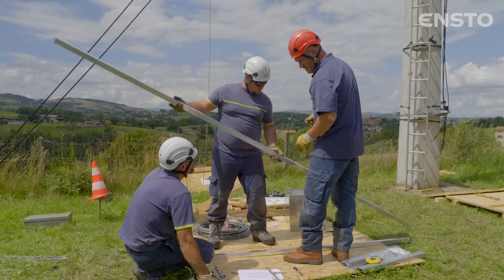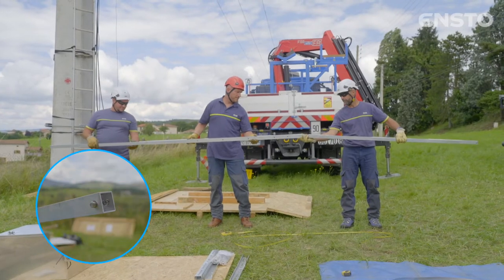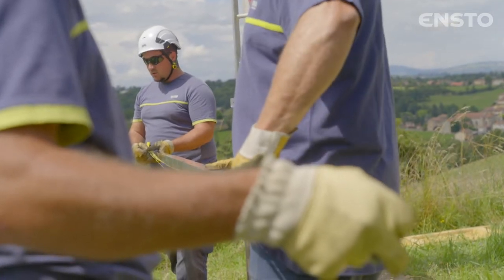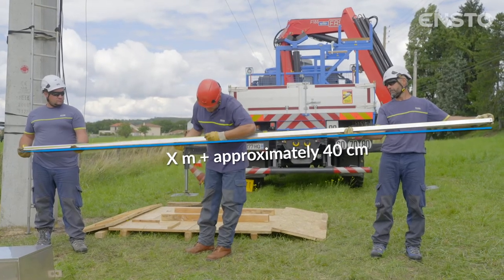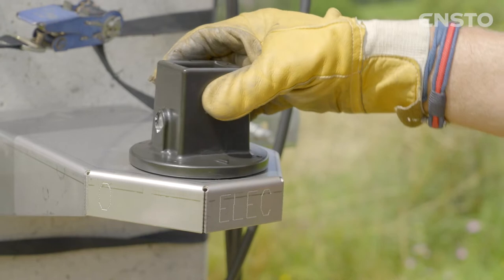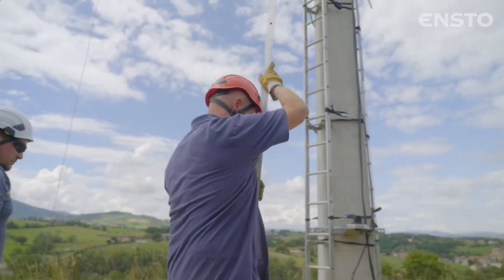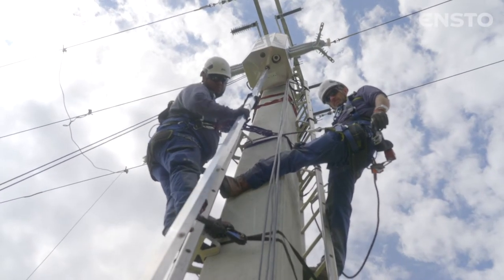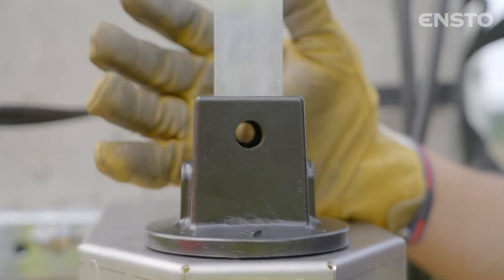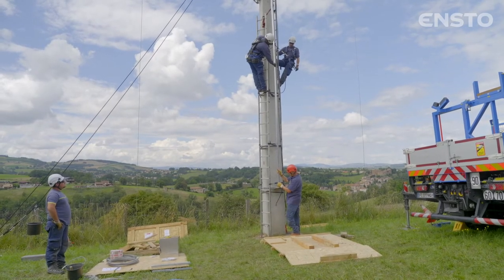Assemble the intermediate male tube with 2 holes, with the female tube with 7 holes. The total length of the fitting assembly must be 40 centimeters longer than the distance previously measured. Place the rotary bearing of the manual backup control in the electric mode position. Engage the rod assembly on the top tube side. Leave the 2 tubes free and sliding. Then, on the manual backup control side, engage the operating lever through hole facing the operator itself facing the structure.